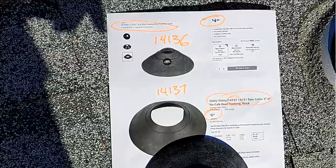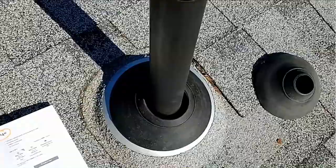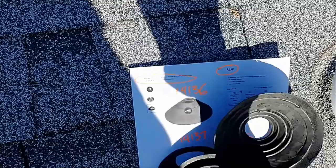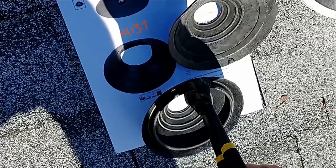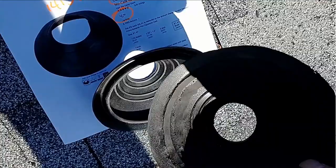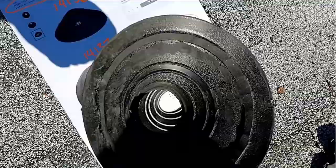I already put the three-inch collar into place. Before you put the one-and-a-half to two-inch collar on top, you want to clean it out a bit. Here's one that hasn't been done yet — what you want to do is take your snippers, go in here, and take the ridge out from the middle. Just get in there and snip it, go all the way around to get a donut of material out. I took one extra step: I took it up to a belt sander and got it really smooth — took that ridge out and then smoothed it out.